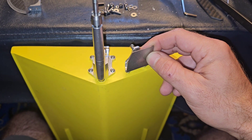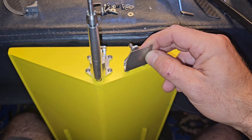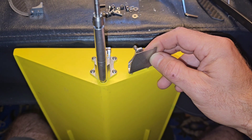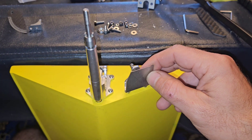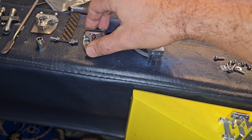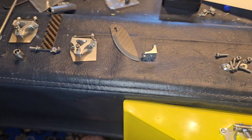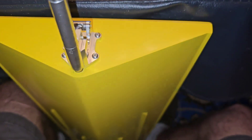What I've typically learned is with dual trim tabs, you don't ever mess with one side of it. So I'm going to try to split the difference and see if that helps. But it'll be the first boat I've built from scratch, so it'll be kind of cool to see what the end result is and how it performs. Plus, these are free — they were donated to the channel. All right, I'm going to get to work on marking my holes and start drilling.